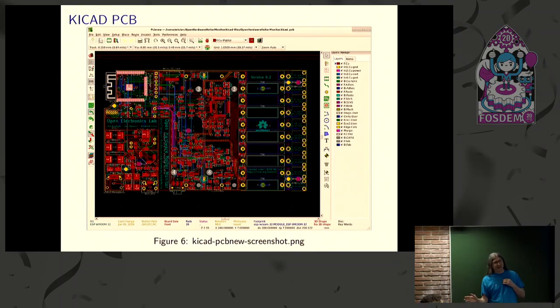And by the way, if you're doing any schematic design, or excuse me, board design today, I really recommend using four-layer boards, because anytime I'm trying to go diagonal across the board, I don't want to try to sneak around all the components. I want one layer that's just horizontal, one layer that's just vertical. I via down, go over and up, pop out, and then I'm there. Really saves time on my layouts.